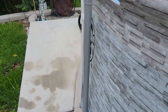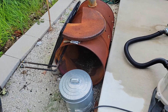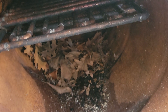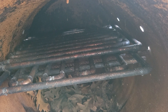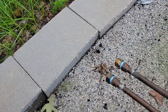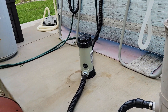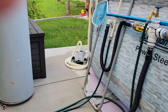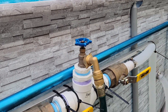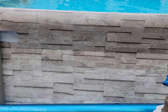Let me show you what the 2.1 version looked like. The 2.1 version was a burn barrel with a small chimney inside it. There were layers of coil of pipe, you'd build a fire where the leaves are, and then you would have a hose running on the inside and the outside back to the pool pump, and it would slowly heat your pool. It worked - it was effective. That was my outlet on my pool pump so I could force water through that, then put another hose inside the pool.